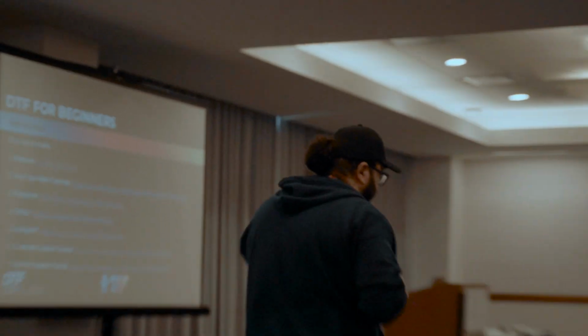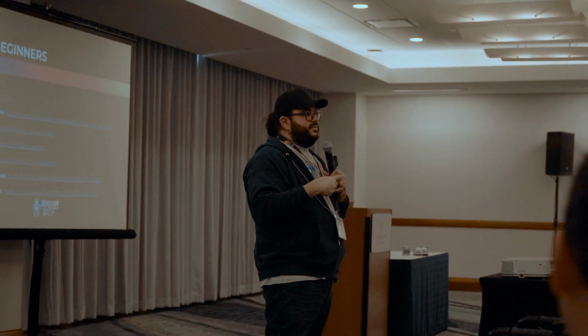Okay. So if you switch over to the hot peel, if you can try hot peel, even if it's glossy, you can see if that happens to you. But I have seen this many times before, and once you switch to matte film, that's all over. That moisture is not going to show anymore. I guess it's the way they do the glossy film. I mean, we're talking about the one with the gloss on the back versus the matte. So yeah, it's nothing to do with the powder, it's the film. I have switched to the matte film and that fixed it.